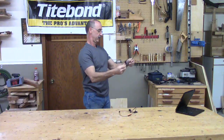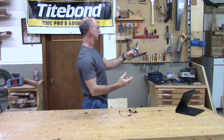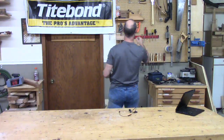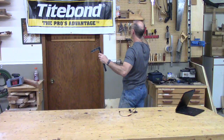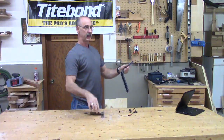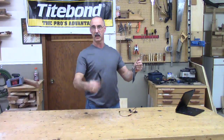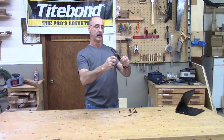One. Well, I don't know. Do we need more information? I'm not sure that these two tools can get us where he wants to go. I'll just add another tool here. I think what he's trying to do is a common dovetail slope of 1 in 6, and I want that on this tool. This is a sliding T-bevel or a bevel square.